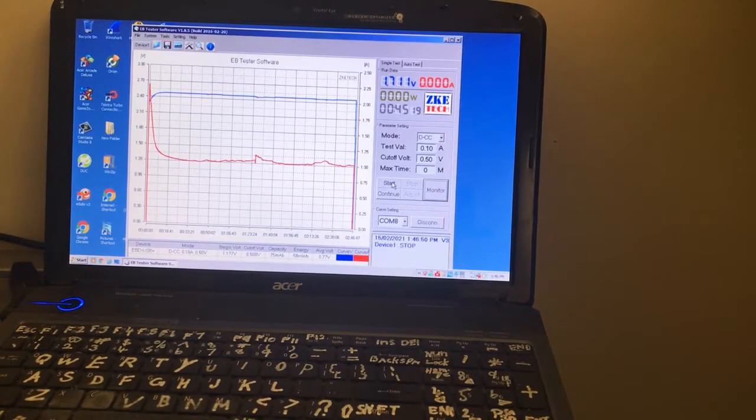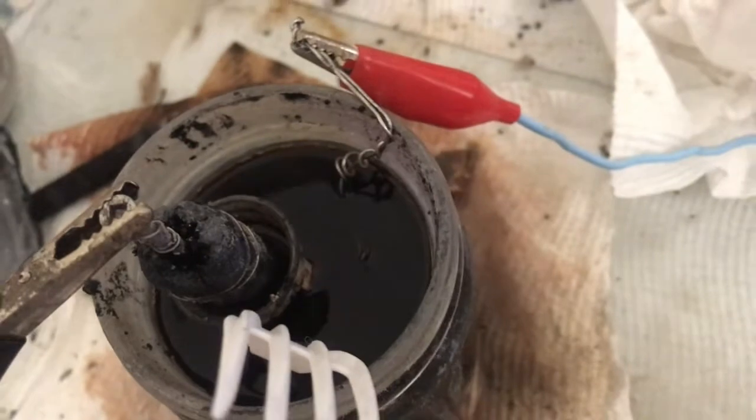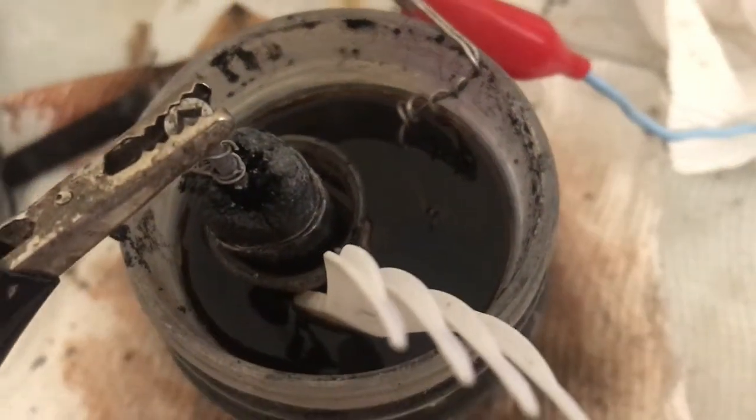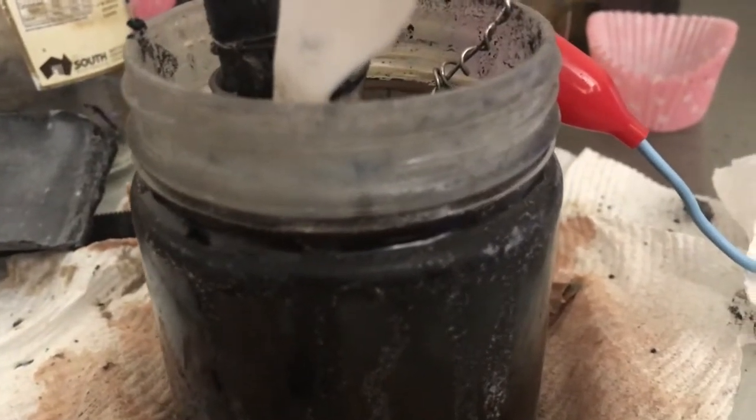Okay, back with the feather carbon cell with the stainless wire now wrapped around it. It's been on charge for 2 hours and 46 minutes and we're ready for a discharge. Slightly smaller because the top part of the cell did break off earlier. It's a 7 molar solution, this one. It's in there now instead of a 1 molar. It's actually frosting the glass, so gotta be careful.